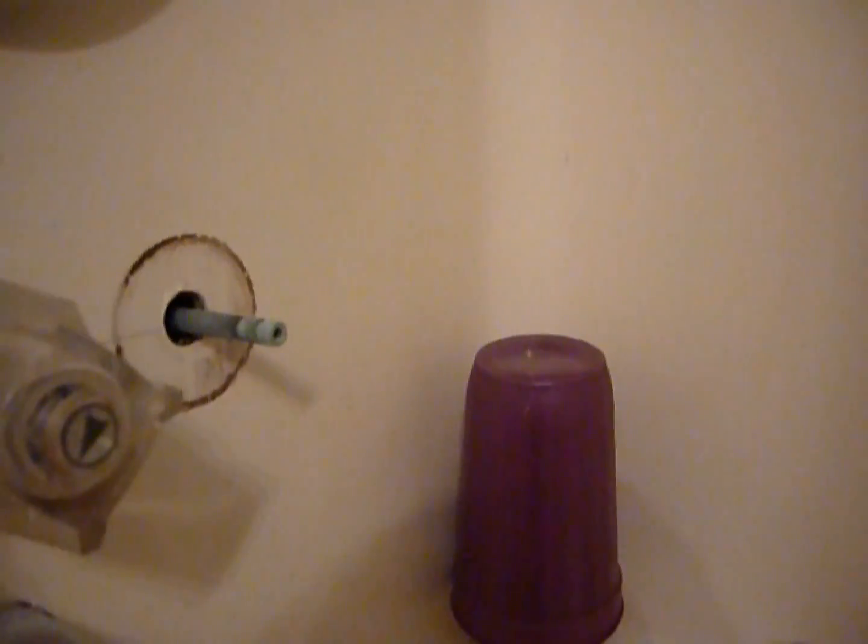But you'll notice one problem. That fiberglass tub is in the way. Because when they install these, they install them just big enough to get this stem through. Never would they have thought of ever needing to repair it. So along with your faucet wrenches or faucet sockets, I have a Dremel tool, a little rotary tool with a little tiny grinding bit at the end. And I just got it grinding. So let me set up the camera and y'all can watch me grind away.